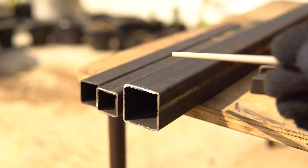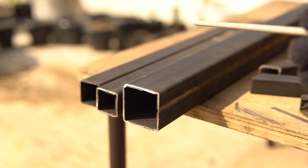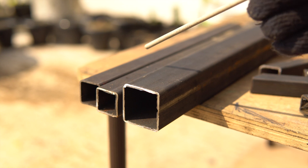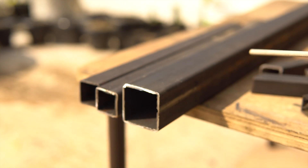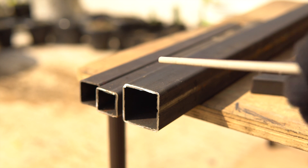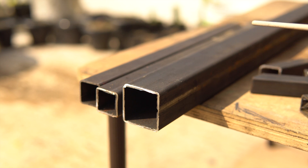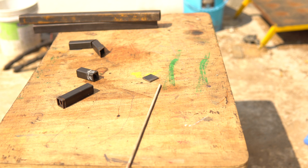For the legs of the bed, I'm using 1.5-inch square tubes with a wall thickness of 1.6mm, cut to a length of five feet, which will be the total height of the two-rack bed. There are four of these tubes. For the rest of the cot, I'm using one-inch square pipes with a thickness of 1.4mm. This bed is for my kids — if you're making it for adults, consider using 2mm thick square pipes for the body and at least 3mm thick pipes for the feet.